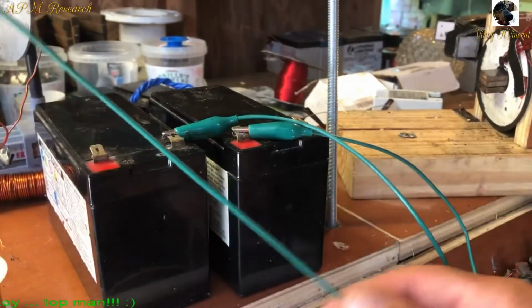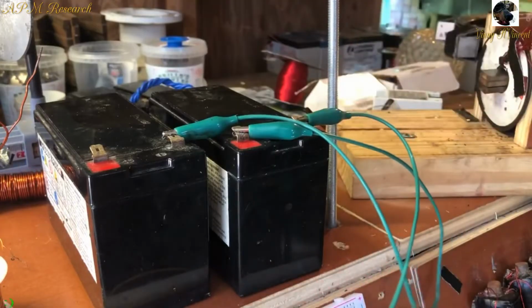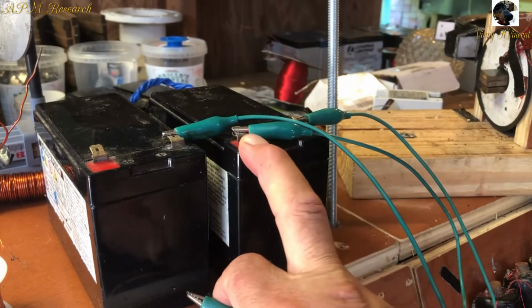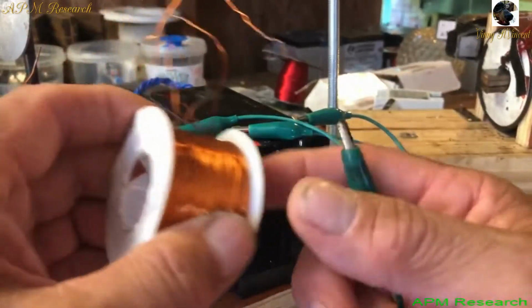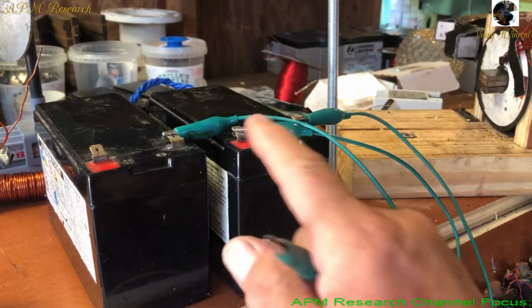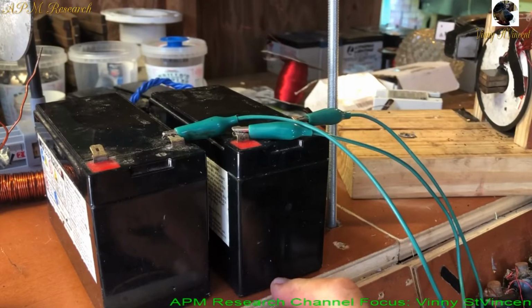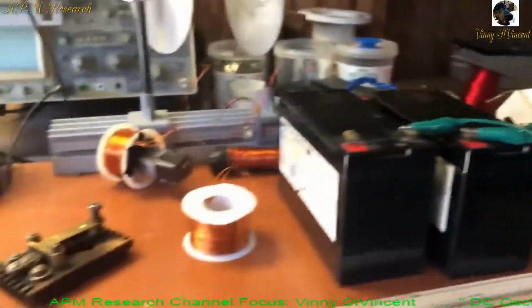You guys that build these at home, just get any coil, wind it up, single coil. What I would do is this. Since you're pulsing, you can handle a lot more voltage and current. But if you design the coil, so if you put the 24 volts that's going into it to where you can just have both ends connected and the coil itself doesn't overheat, you know you have the perfect design coil. Now when you go to pulse that, you can probably go up double the voltage, if not just a little bit less. That means you can pulse 48 volts through that and the coil won't even feel warm. It's because why? You designed the coil properly.